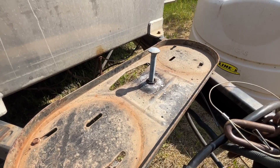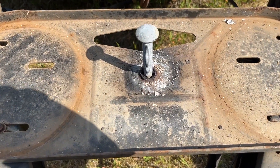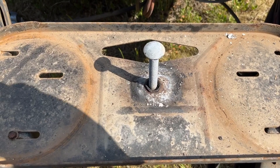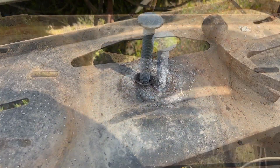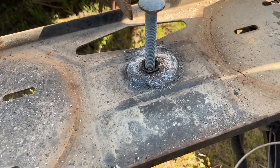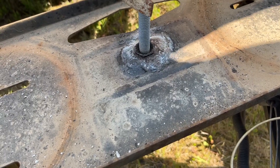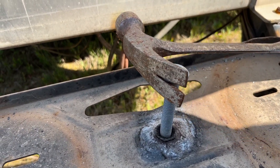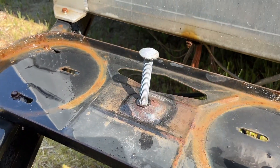That's really strange — it cooled back down and went back over into its leaned position. I'm going to have to repeat the process, and rather than just knocking it vertical, compensate and go a little bit the other way — maybe even tap down on the metal on this side. I've heated it up again and knocked it so it's sitting a little bit to the right, and I've struck it a couple times on this side. When it cooled, it didn't have the memory it had last time. We are now nice and straight.